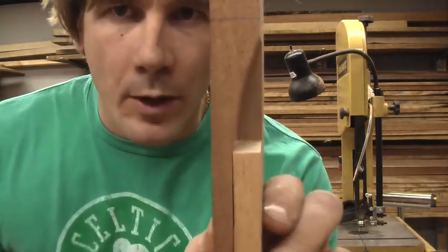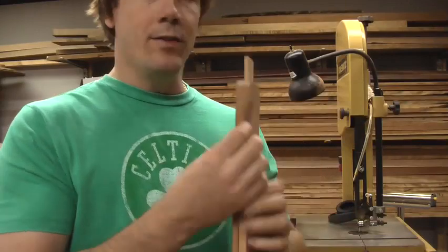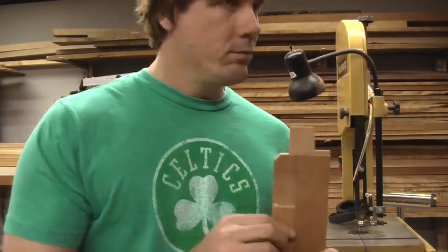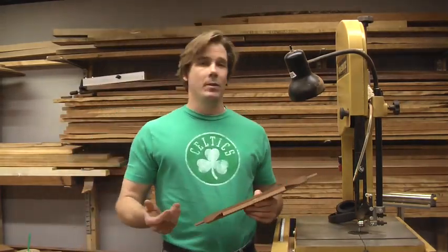Check it out. You see how I just cut — there's a plunge cut here and here, I just plunged it and then I stopped it on the table saw. 7/16 inch deep, inch and a half, inch and a quarter wide or something. So the next thing I need to do is cut the scallop shape on the bandsaw.